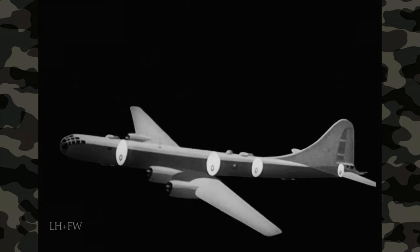And the co-pilot doesn't just sit and read the checklist. He must test the action of the control surfaces — moving each surface: elevators, ailerons, and rudder through the complete range. The gun commander looks from his blister, observing the response of the surfaces, and reports to the co-pilot. A similar test is made on the trim tabs. The co-pilot turns the three control wheels as far as they will go in each direction. That big wheel on the side of his control stand operates the elevator tabs. The aileron and rudder wheels are on top of the control stand behind the throttles.